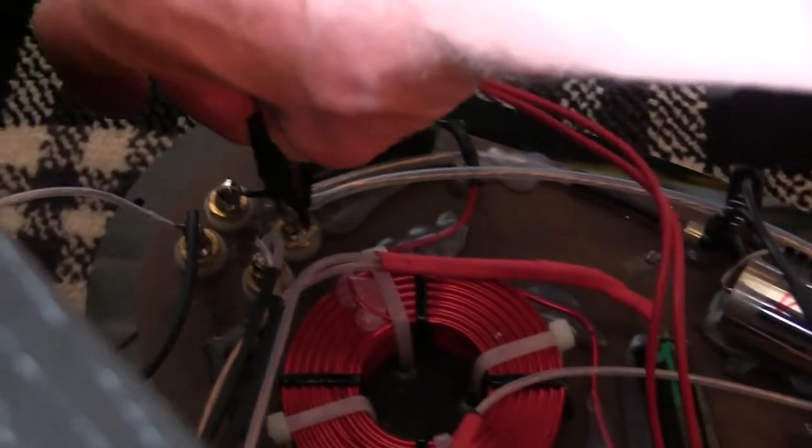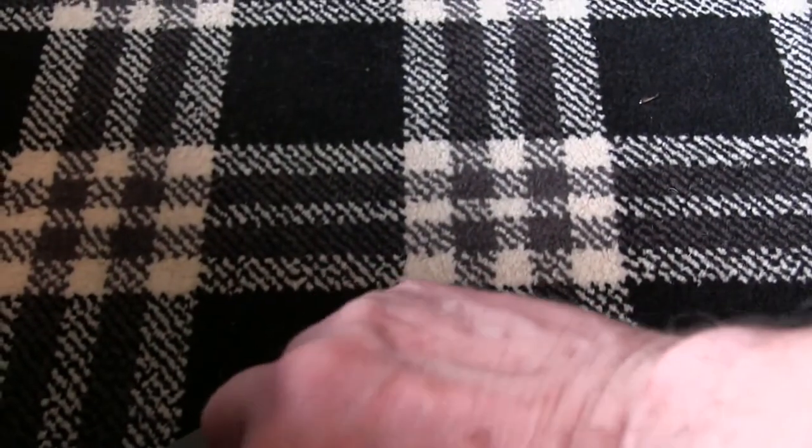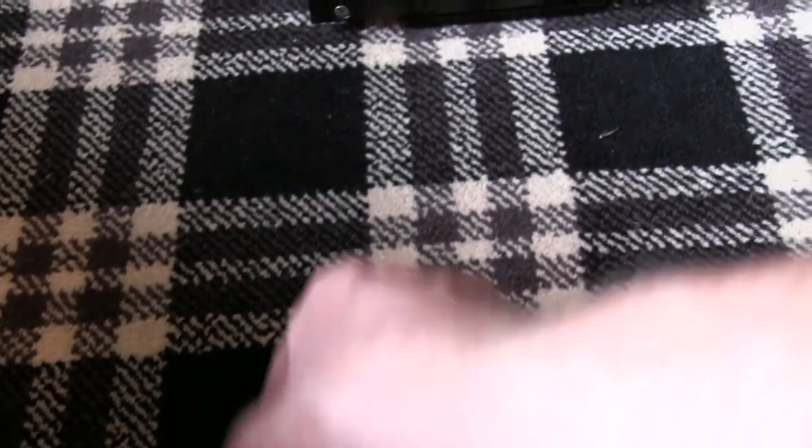So I then checked the other circuit. If I just remove the clips, put that clip on one side of the Bybee. Luckily the terminal was not insulated, and on this terminal down here. You just have to get a good connection on these, because it passes a tiny current and then measures the differential voltage. When you're measuring very low resistance, you've got to get a good connection or you won't get a proper reading. Just get that on there.